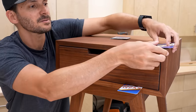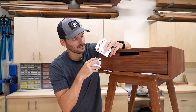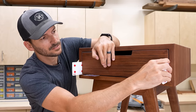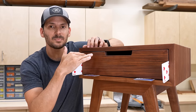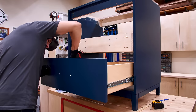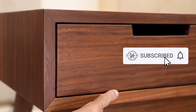It is now perfectly aligned top to bottom. I'll do the same thing left to right — the stack of nine separated in half gives me five on one side and four on the other, and it's okay if you're off by one card. With the cards stuffed in, the drawer is completely and perfectly spaced. Now all you need to do is put a clamp in there, pull it out, and secure it from the back — or run screws through a drawer pull from the front — and you will have perfect drawer spacing every time.